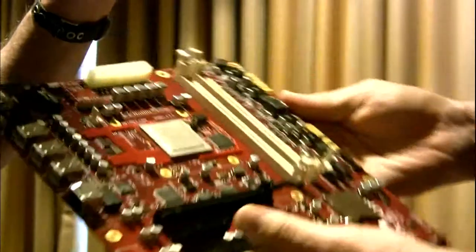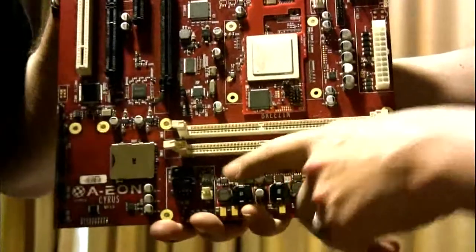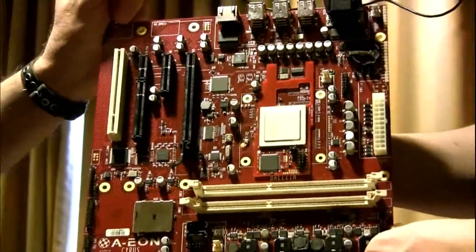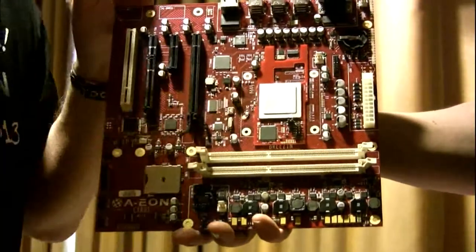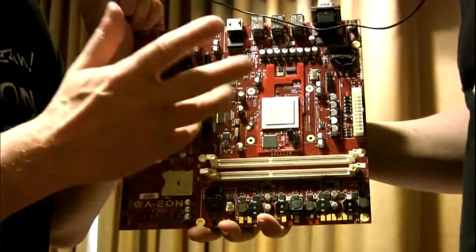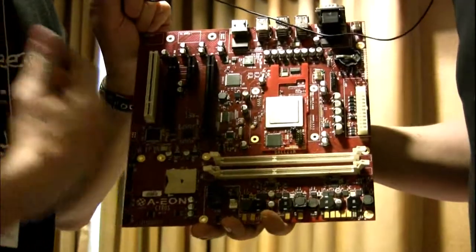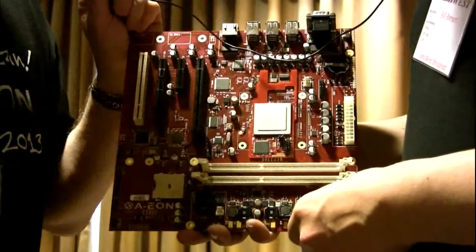What else have we got in here that we can really point to? I see that we have a dual SATA. Yes, dual SATA, at the bottom there. I notice we have the clock button up here. Any other interesting hardware features? Not on this board, really. There's no South Bridge. So it's an SoC. This does it all. The audio is PCI. We did that deliberately because we wanted to have something up and running very quickly. But the Ethernet is from the CPU.